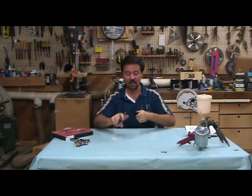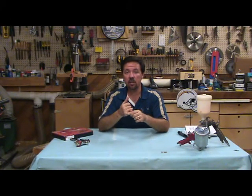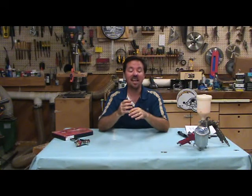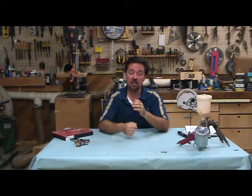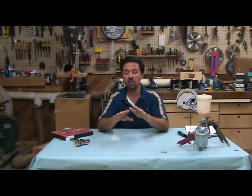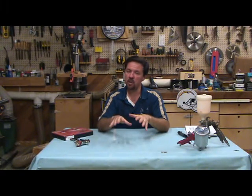That is it. That is, in a nutshell, your spray guns. Touching quickly, air-assisted airless is an airless piston operating. It's a piston that's operated off of air. Air pipes in, causes the piston to go up and down. Cadillac of systems, gives you the best finish overall. Love using it. It's quiet as all get out. You don't consume a ton of air. A little bit pricey on the machines.